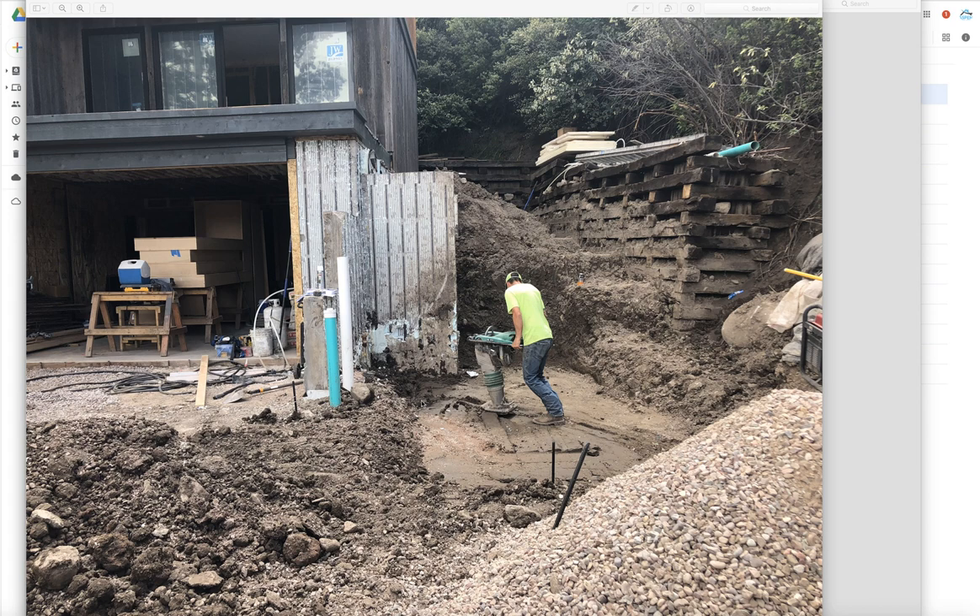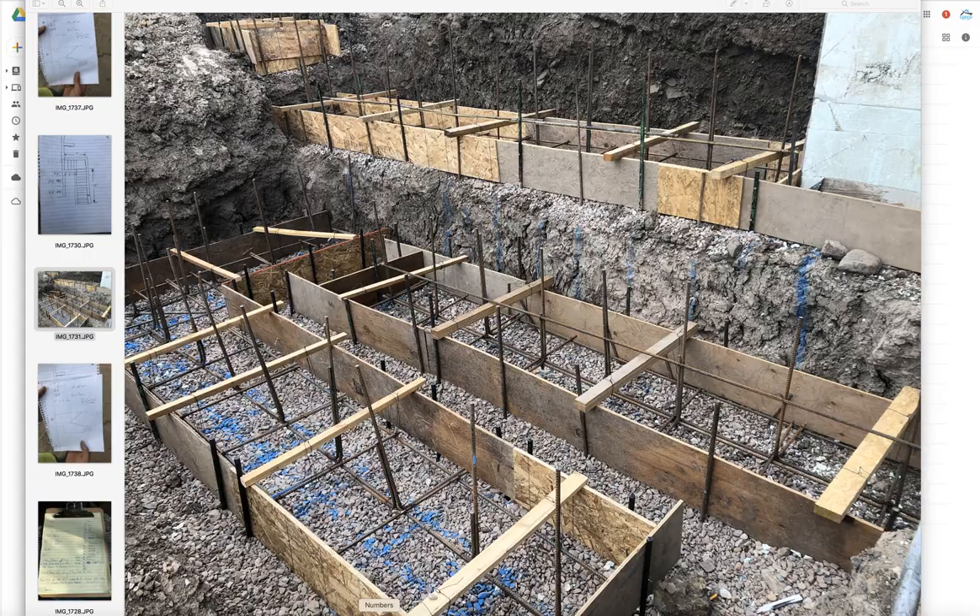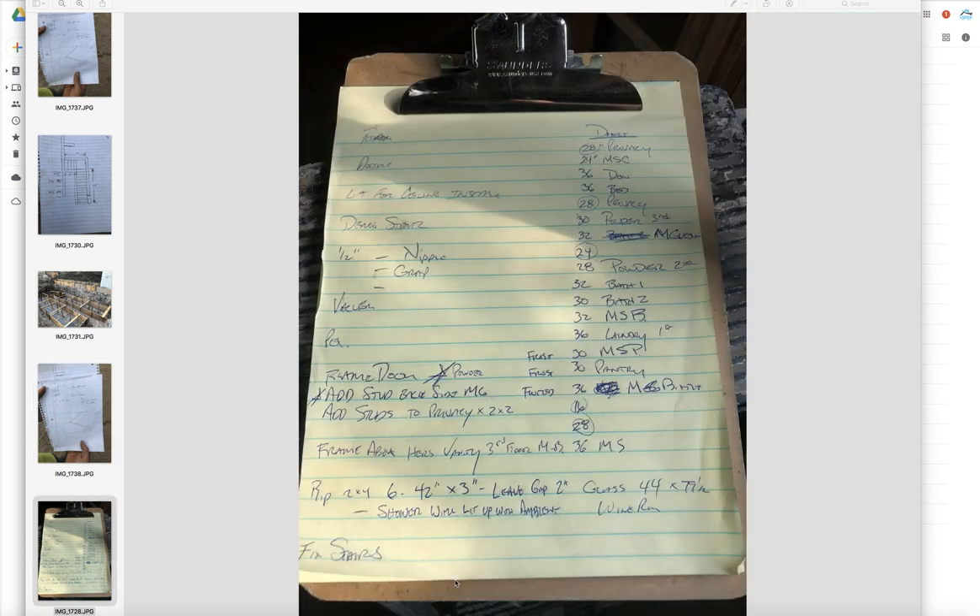It kind of looks like stone. I need those drawings right here — the stair and then the stair. Thank you very much. Andrew with Ascent Engineering. We're looking for approval on our stairs on both sides, north and south side, with our rebar and our takeoffs as we've done it. We have our uprights, verticals every 16 inches, all number 4 and number 5 bar. Hopefully that's sufficient — let us know what we need to do. 30 inches wide, 8 inches deep. Thank you very much.